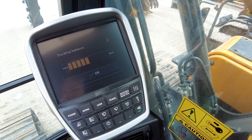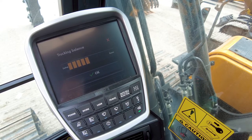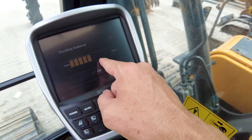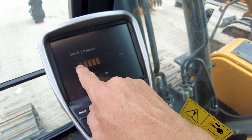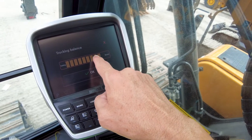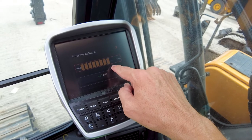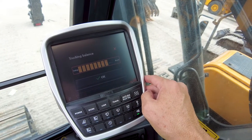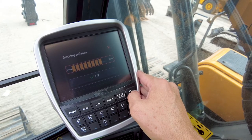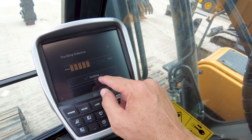The trucking balance — these machines used to have something called boom priority, and that's basically what the trucking balance is, but now you have additional options. It's not just boom priority on or off. You have the ability to adjust the amount of flow proportioned from the swing and from the boom. Think of it like a scale: the more you orient towards swing, the more flow you'll have to swing, and vice versa for the boom. If you're primarily loading trucks, you'll want to be oriented more towards the boom so you can get up and over the truck bed quicker. If you're doing general excavation, grading, or land clearing, you're better in the middle or even more towards the swing. I normally start in the middle and see where to go from there.